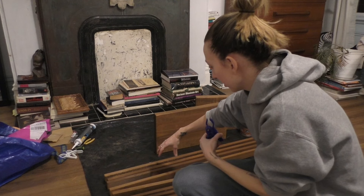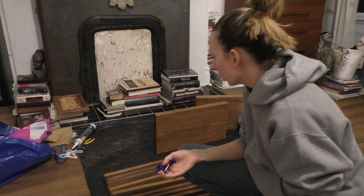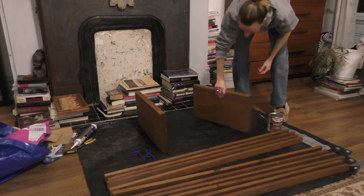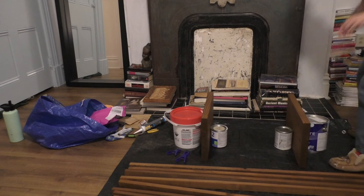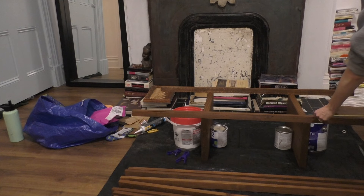Normally you would not want to do this the way that I'm going to do it — you would put these right side down, put them in here, glue it, then flip it over and nail gun the top. But my nail gun I got a long time ago and I never figured out how to make it work, so that's a conversation for another day. We're going to glue it and do our best. The clamps are going down and we're using liquid nails.